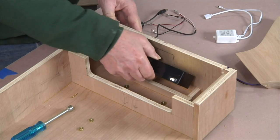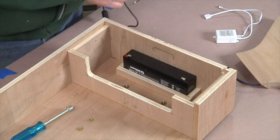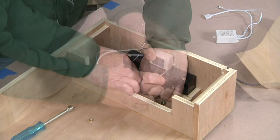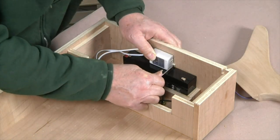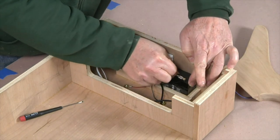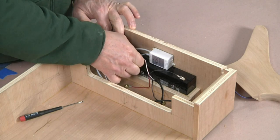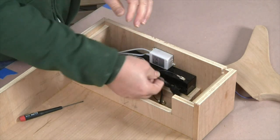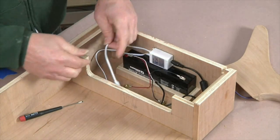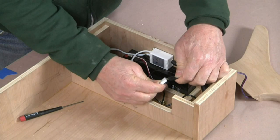The sealed lead-acid battery can now be set into its shallow housing and the wiring connected from the screw terminals to the switch. I mount the control box just above the battery to keep it from lifting from the housing. Then I connect the battery wires and plug the power connector into the control box. Finally, I attach the multi-wire lead coming from the slot in the leg to the control box.